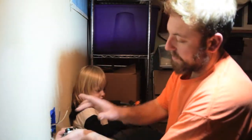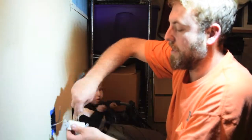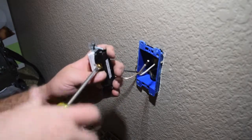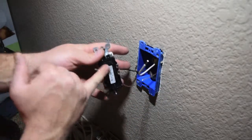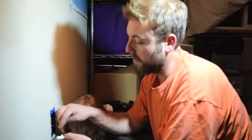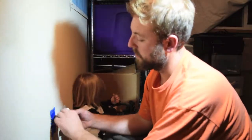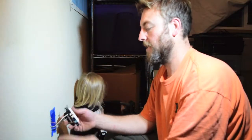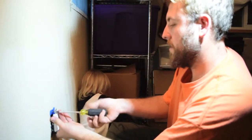Take my ground and twist it down so that when I tighten it up it will get tighter — see how it turned over that way. I'll tighten up my screws here that I would use for 12 gauge wire, because I don't need them protruding out inside my box and creating a hazard. This is 14 gauge wire, so these plugs have holes in the back that are made for 14 gauge. Black wire goes to the brass screws — black to brass. Neutral white wire goes to the silver screws. Give the wire a little kink up and down, and put the screw into the box.